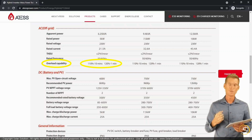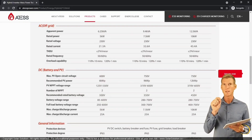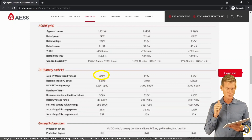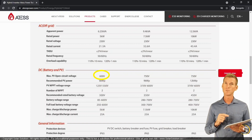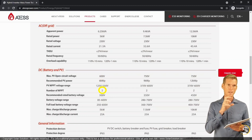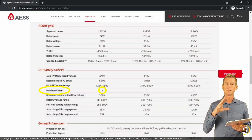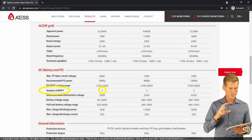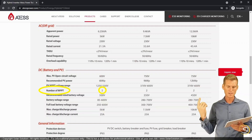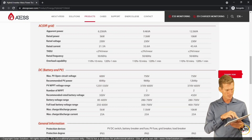In the third section we find values for the solar panel and battery connections. The maximum open-circuit voltage from the panels to the hybrid inverter is 600 volts, which is really good — you can build very long strings with high voltages. It also has two separate MPPT trackers, so you can make two separate groups of panels, each connected to its own MPPT tracker. You can visualize this as the hybrid inverter housing two separate string inverters: one string up to 600V open-circuit on one MPPT, and another string on the second MPPT.